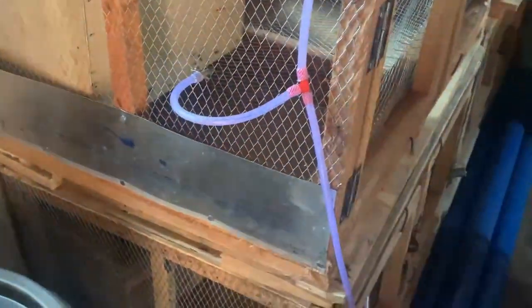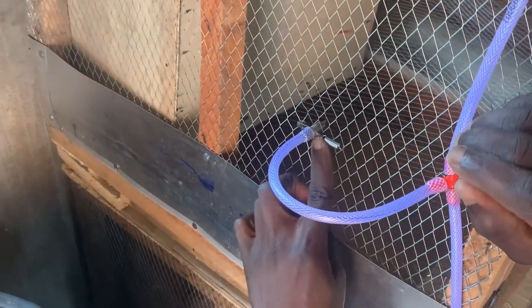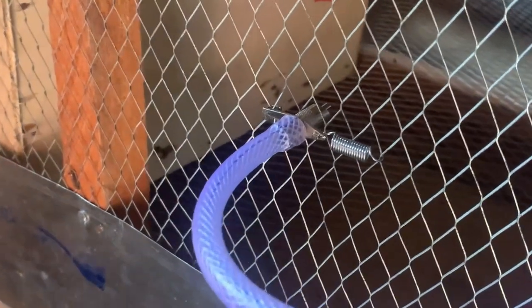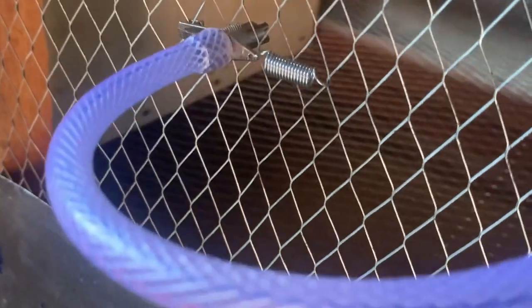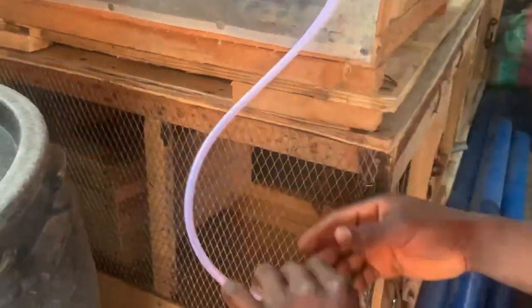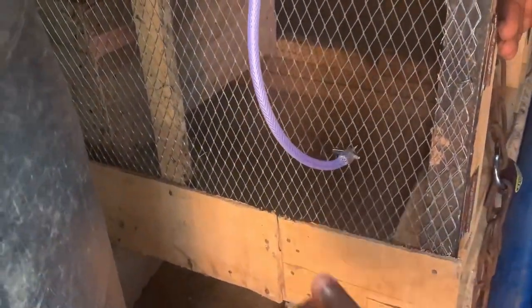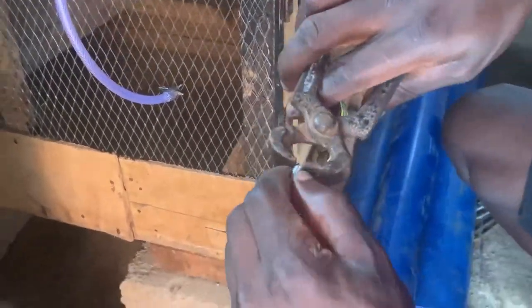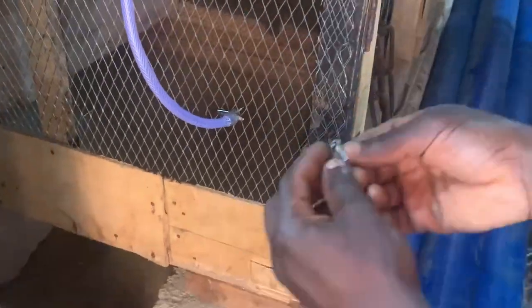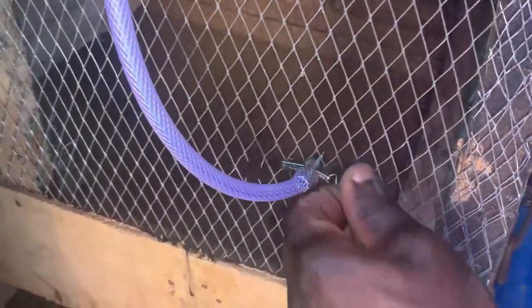This was when I was binding it with my binding wire. Then I needed my nipple — this is the mount of my nipple — and I took it to the cage. This is how all the nipple drinkers were fitted to that particular cage. Before you know it, the cage will be supplying water. You can see my spring there holding it very firm. You hang your spring in the little hole in your nipple and it hangs on your net. Then I was creating a hole for my nipple that goes below the cage, put in my nipple, and hung it successfully.